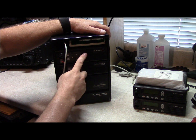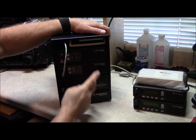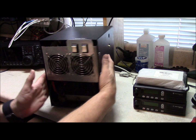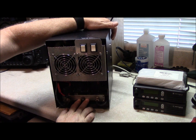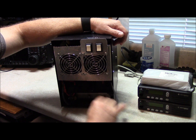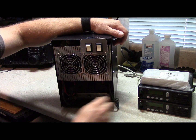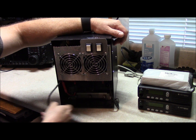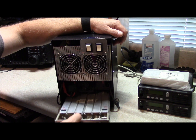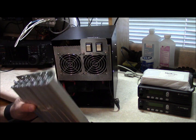I have a receiver here, a transmitter here, and this is a power supply down here. And I have a duplexer down here. The cliff notes on a duplexer are simply that it allows a transmitter and receiver in duplex operation to share the same antenna. This duplexer here is a simple notch-type, flat-pack, six-cavity duplexer, which you can get on eBay for usually around $100 or so. This one's UHF — it's a small form factor.